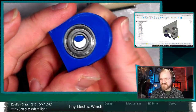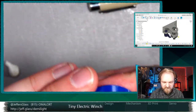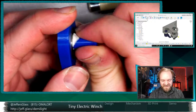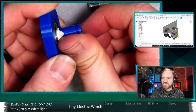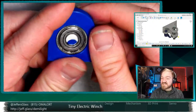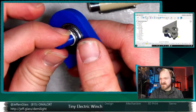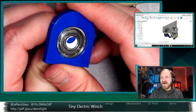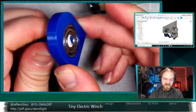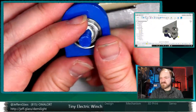That actually worked out pretty well as a fitting device. And I can already tell it's so much smoother than PLA on PLA as an axle bearing. It's hard to get this to come across, but I can push down quite hard on that shaft, and the rotation is still not a problem. And that makes sense, right? These are nominally skateboard bearings, which is at least the name they are often sold under. They're meant to allow an axle to spin while a human is standing on top of them, or on top of four of them, in the case of a skateboard. So the fact that they handle side loading and rotation well is sort of the whole point of the thing.